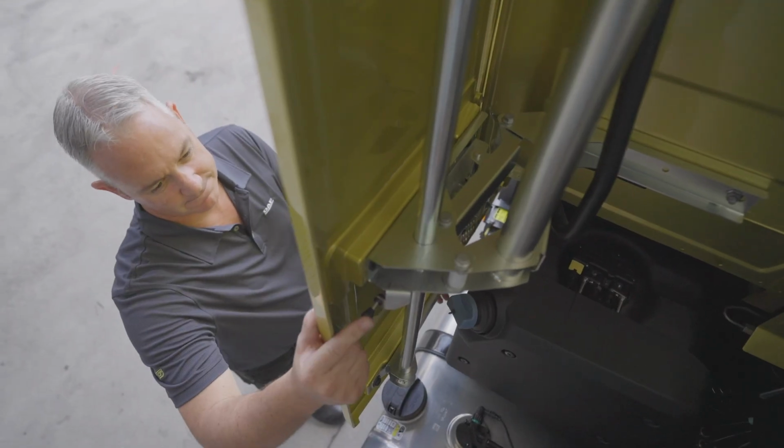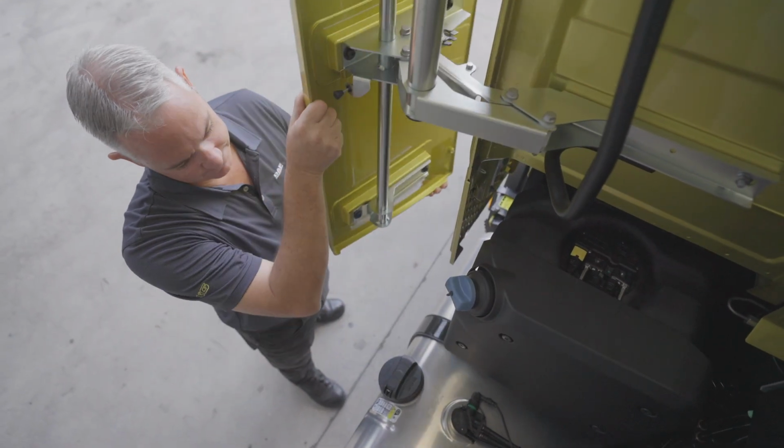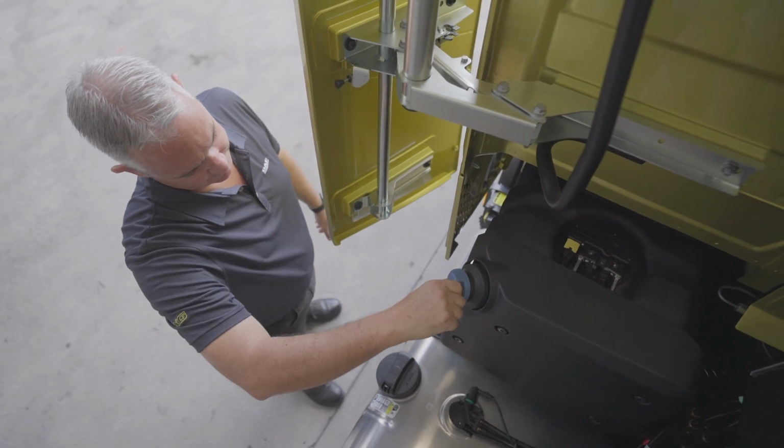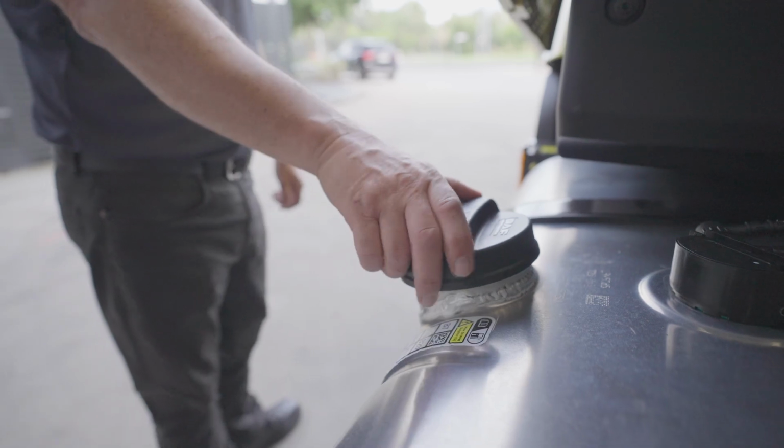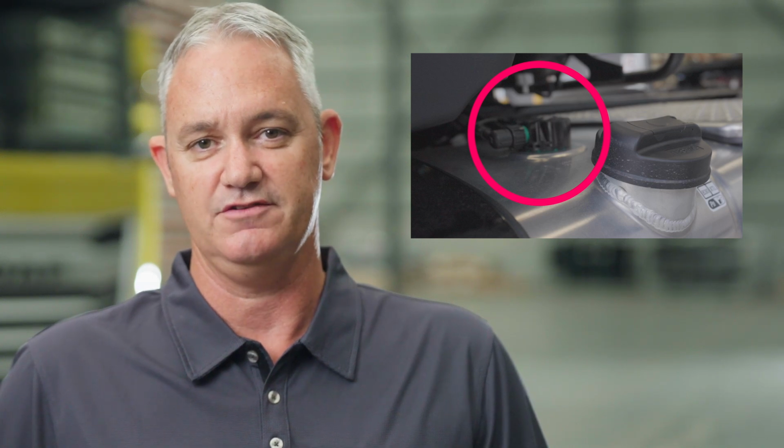Our passenger side fender has a release button. This fender pulls out and swings forward to give us easy access to the AdBlue fill point. We can check that the fuel tank cap is secured. Refueling the truck should occur by filling the main tank first, recognisable by the external part of the fuel tank float, and then the auxiliary tank.